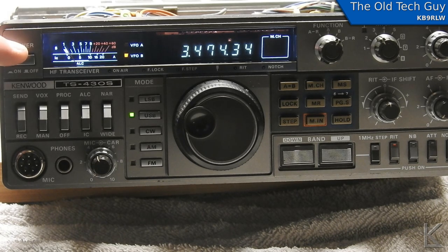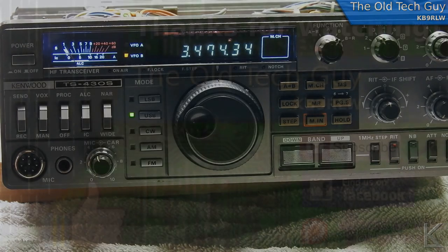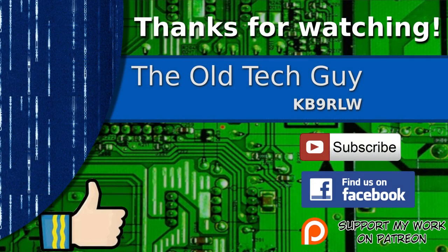This meter is now lit with a white LED that should last for many, many years and remain just as bright and brilliant. I tapped power right off the power switch and just picked a ground point down here on a PC board in the back of the switches for ground — and that's it. It couldn't be any easier. I hope you found that useful. Thanks for watching. If you enjoyed the video, don't forget to give it a thumbs up. If you're not already a subscriber, click to subscribe. Join us on the Facebook channel for discussion about the videos, and if you'd like to help support this channel, please click to support me on my Patreon page.